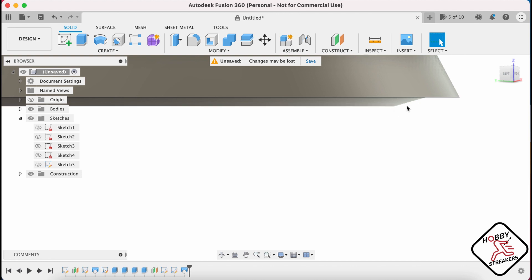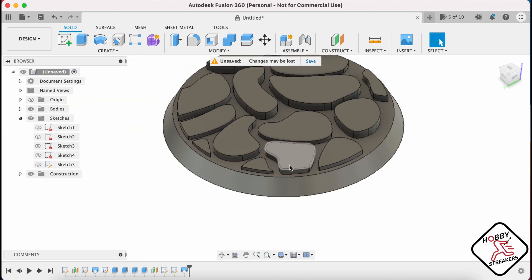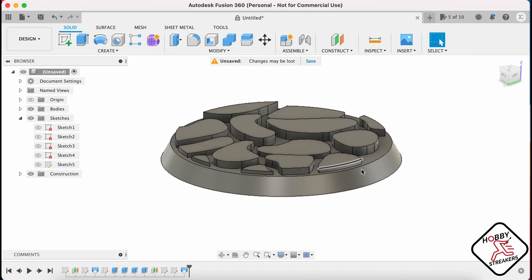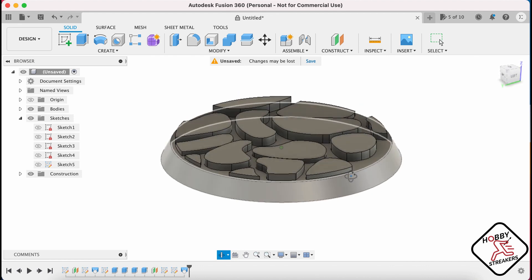When it's gonna print, it's gonna print the layers. Those first layers are at 0.025mm, so they're gonna start bleeding out. And basically, by the time the initial layers are done, they should be about at the edge. You want to do it so that you will have a space that you can actually slide your scraper in and just remove the base. You have a full base that is basically ready to go, and you can print it just flat as it is.